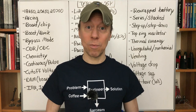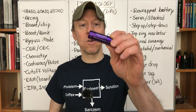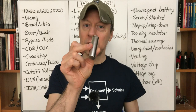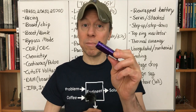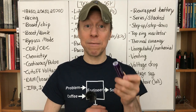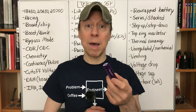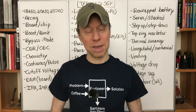Wrap — the critical plastic wrap around your battery must stay on. Do not use a battery with a damaged wrap — it could explode. You must keep the wraps intact and in perfect condition on your mod. If they get damaged, rewrap them carefully — there are a lot of videos about this. You can get wraps at batwrap.com. When you buy batteries, buy wraps and top ring insulators too. That's everything for tonight — thank you for watching.